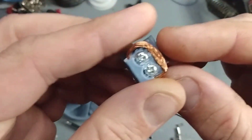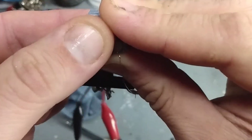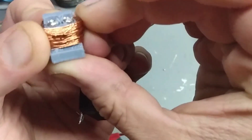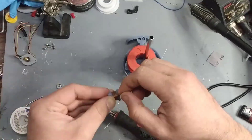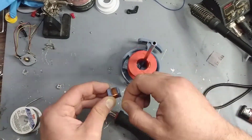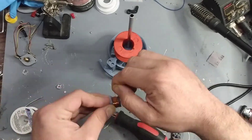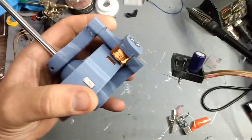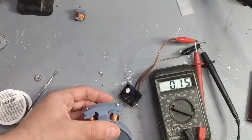A word of warning to anyone who downloads this and attempts it: make sure the magnets are really well glued in. I had one come out and take out a coil and hit my leg. If you're going to try this with a vacuum cleaner or air pressure, make sure to stand clear and wear safety glasses. For the coils, the wire I'm using is 0.3 millimeters in diameter with about 130 wraps. For the core I'm using a 3D printed frame with steel screws — preferably I'd machine these from steel, but for testing the screws will do.